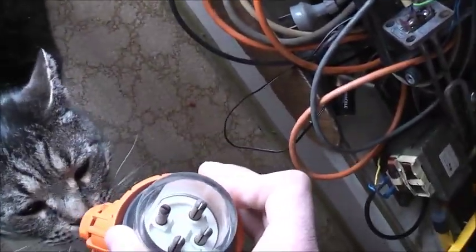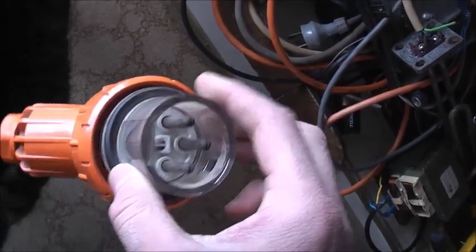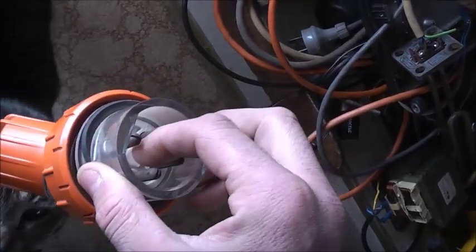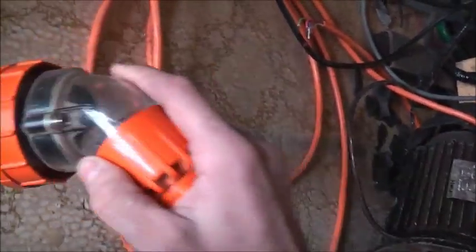In this case this was a switch mode one, you get your 3 phases for the main part of the switch mode power supply and the neutral. It depends on the application or the machinery that you're using. Most of them are 4-pin, but we always have a 5-pin socket handy because a lot of machinery is 5-pin as well. Commonly, if you're running a motor straight off 3-phase, straight off a plug, it'd be a 4-pin configuration.